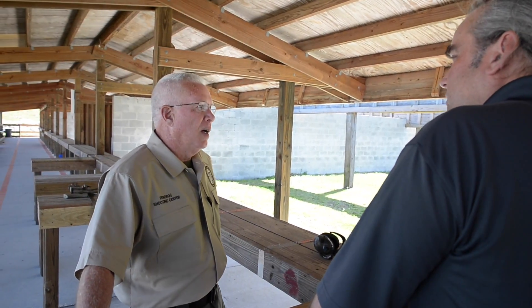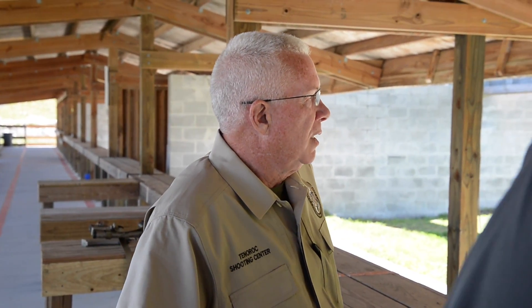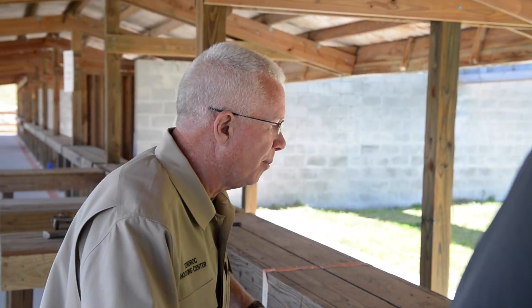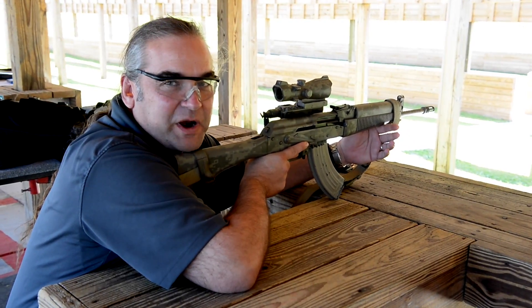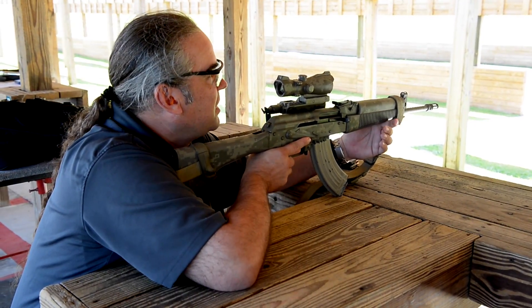What did you have to do to rehab this range? Pretty much the same as the rifle range — we've rebuilt all the baffles complete with the staylight rock filling, had a contractor redo the drainage and the berms complete with the ballistic sand pad on the face of the berm, resloped the berms to the designed degree, and added five feet of height hoping they'll settle an additional three and a half feet. There's no blue sky. This is my first time shooting in a baffled range of this type — we're very curious to see what this does to the sound, plus we've got this space-age coating on the roof of this shooting station.